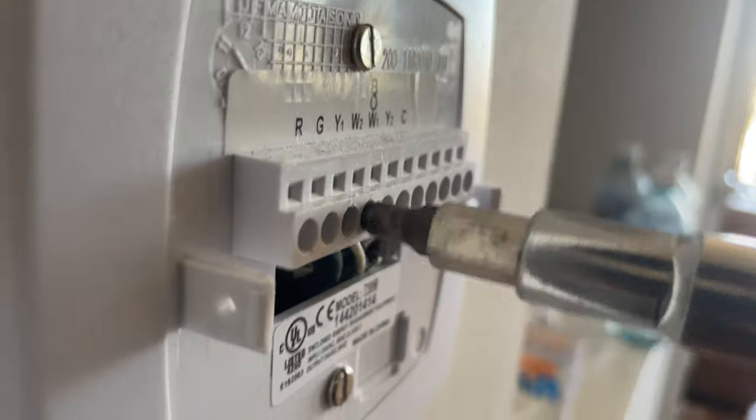That's how you swap out a dual shaft ECM blower motor for a furnace or air conditioner. The symptoms I was getting were that the motor would just stop working even though it still had 24-volt power going to the unit — we'd flip the breaker and it would kick right back on, happening about four times. Not sure of the root cause, but we see this a lot with these motors. Sometimes tightening down on the green or fan wire at the thermostat has resolved it for months, but in this case I had to replace the motor because I was sick of getting called out for this unit not cooling. Thanks for watching — tips, tricks, and comments always welcome.